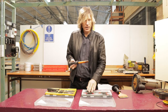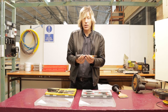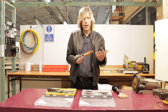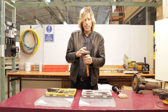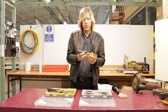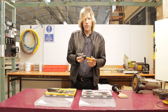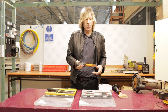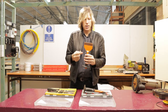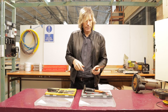You wouldn't use a cold chisel on timber — that's what a wood chisel is for. As electricians we use the cold chisel fairly often because a lot of times we have to run conduit or cabling through brick or concrete and this is what we'd use to make those holes after we've drilled it out a bit. It has a hand protector because we're going to have to hit it pretty hard with a hammer and we don't want to hit our hands or knuckles. They come in various sizes and you also have larger chisels if you've got to take out more material.